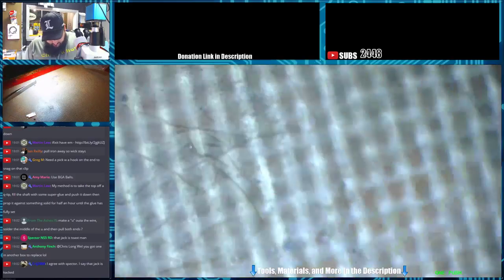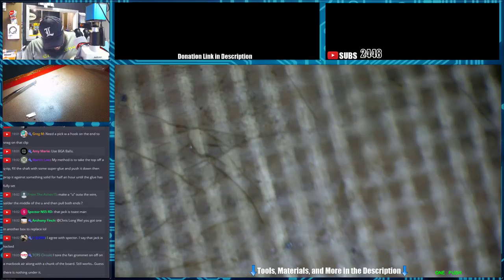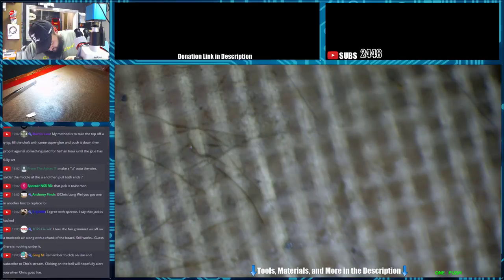So the way I attack these is I like to get them on either side of the LCD panel. Get up under the edge of the glass. And then once I'm under the edge of that glass, I like to use my guitar pick and just work back and forth along the edge of that LCD panel. Then once I feel like I've gotten it far enough down one side, I can go across the bottom edge.